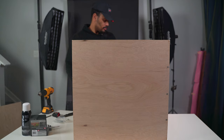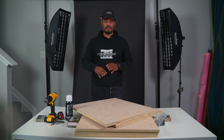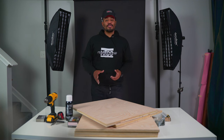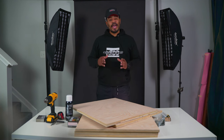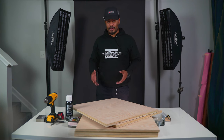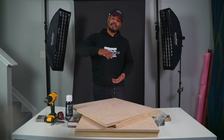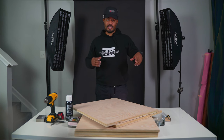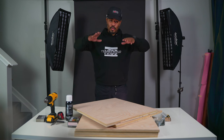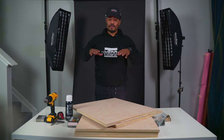Okay, so now you see why I got everything the way I got it. I wanted everything to be perfectly square, 24x24. So by making those cuts the way I did, everything should fit in a 24-inch by 24-inch form factor. And that's how I want it to be, except for the top where I'm using those dowel pins, so that if I want to remove the top board, since the weight of the person will be sitting on it, it'll be pretty much secure with their weight and those set pins.